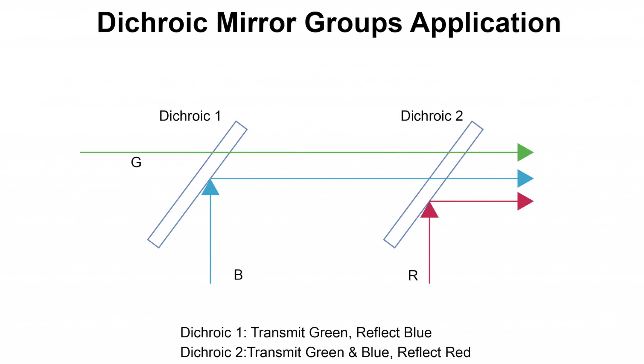For our purposes, a typical dichroic mirror used in a laser may reflect light in the blue and green part of the spectrum while allowing light in the red part to pass through. This makes it useful for combining or separating different colors of light. Long story short, you can control what gets reflected versus passed through by controlling the thickness of the film relative to the wavelength of the light color in question. Perhaps a diagram will help. Let's say we have a green laser beam and we want to combine our red and blue lasers with it. We place a first dichroic mirror at a 45-degree angle — the green laser passes right through, but the blue laser fed in at a 90-degree angle is reflected and aligned with the green. We then use a second dichroic mirror, which allows green and blue to pass while reflecting the red. The red is brought in at a 90-degree angle as well and reflected along the same common path. Now we have all three lasers combined into a single path.